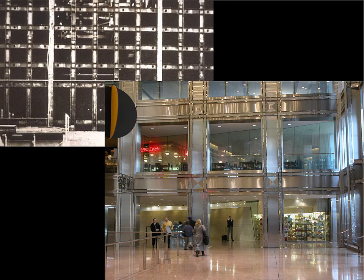And this is an example of the structure of the Sears Tower. All these steel vertical members and the horizontal members have been welded carefully together with full penetration welds at all these joints. And then the field connections are bolted connections there and there and there and there and there and so forth. And this is what it looks like while it's being constructed. And then this is what it looks like after it's clad in this really beautiful stainless steel. There are a total of two of these sheets of material running through the core of the building, and then sheets of material along each of the faces of the building, which creates nine tubes, and they're mutually braced sheets of material at the corner of every one of those sheets.